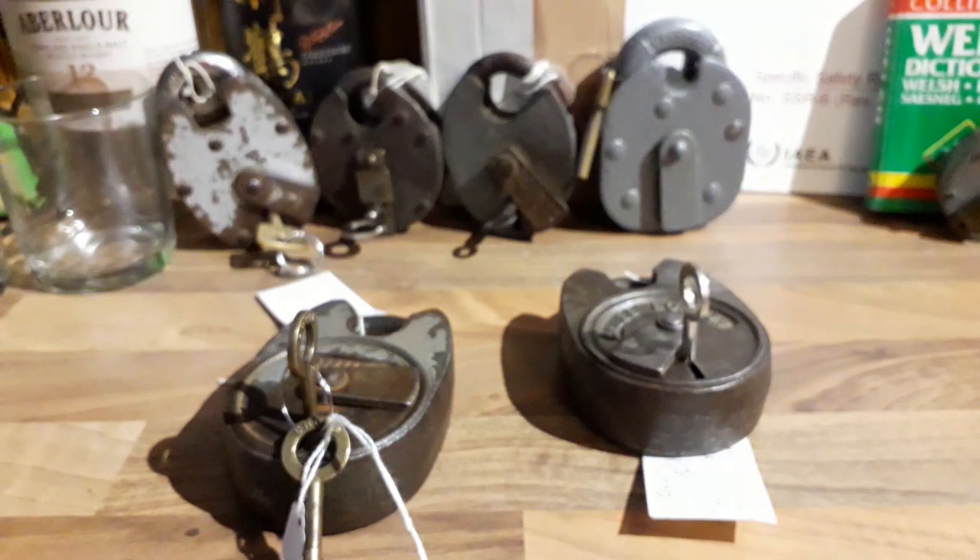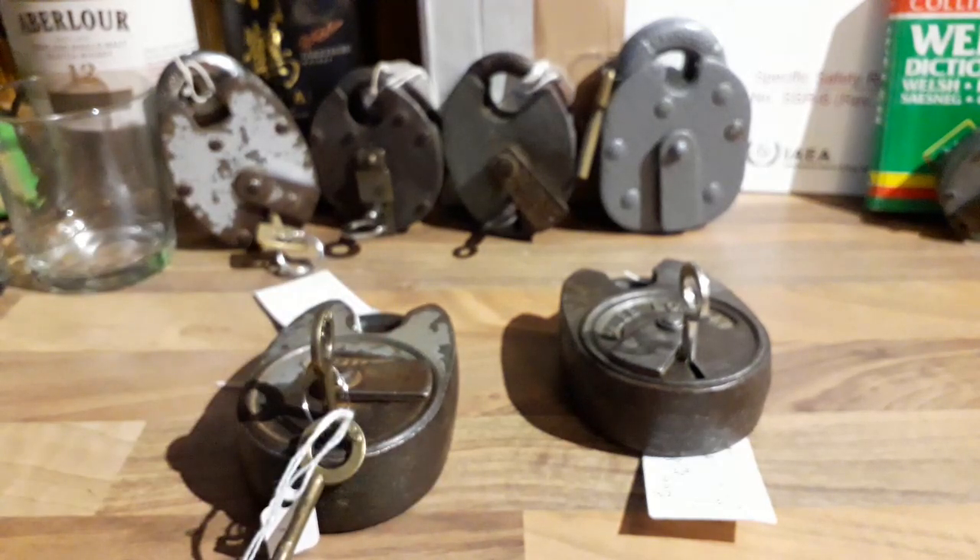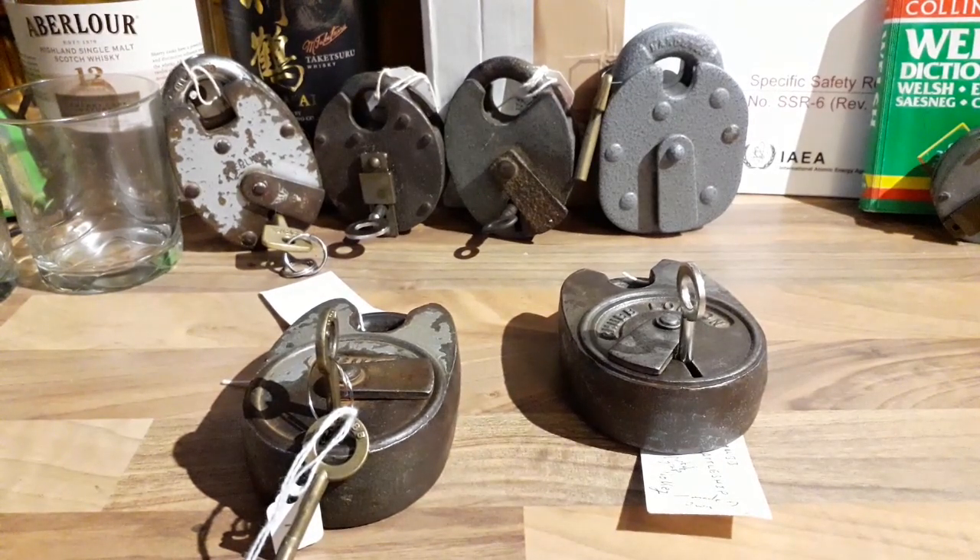The patent is designed around cabinet locks or door locks, though it looks more like cabinet locks from the design. There are two actual designs within the patent: one for 'open levers' — like in the Chubb battleship — which are normal-shaped levers that lift from the bottom as the key moves past them. There's also a design for 'closed lever' locks, where you put the key inside the centre of the lever rather than underneath it, and the key rotates all the way around the inside. They had designs for both horizontal and vertical locks, which are slightly different.